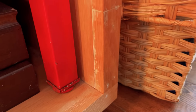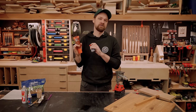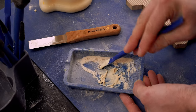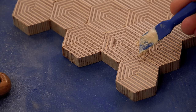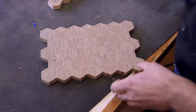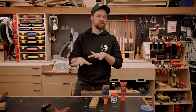I err on the side of going darker rather than lighter, because lighter calls more attention to itself. Another option is wood glue and sawdust — a pretty common DIY filler. I've used it a lot on pattern plywood to fill gaps and match colors that are harder to match. Just be careful with larger sections, because it can mess with the sheen of your finish.